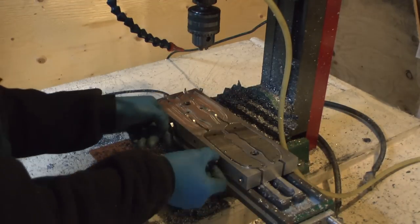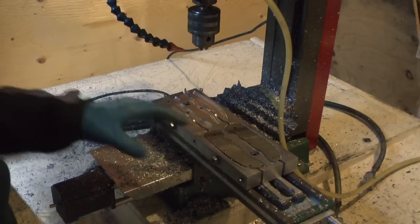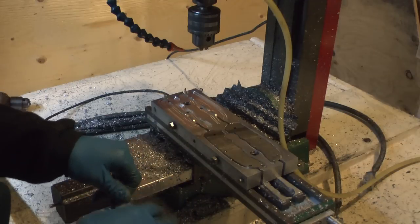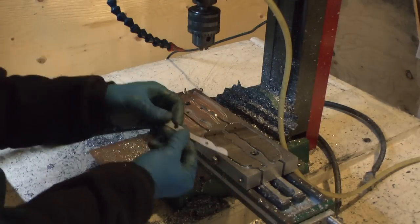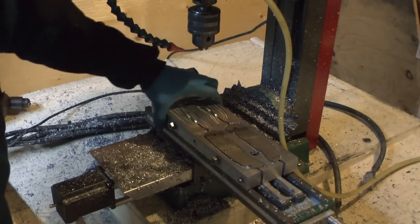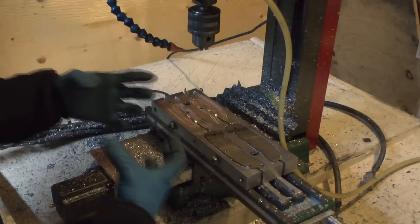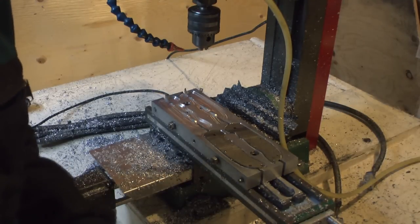And then just tighten down the bolts. And with any luck, it should work. Now, I've made a soft jaw to do two pairs of handles at once. I only have one pair. So on the other side, I'm just using 1/8-inch spacers so that when I clamp it, it's actually gripping on something. That's my soft jaws.